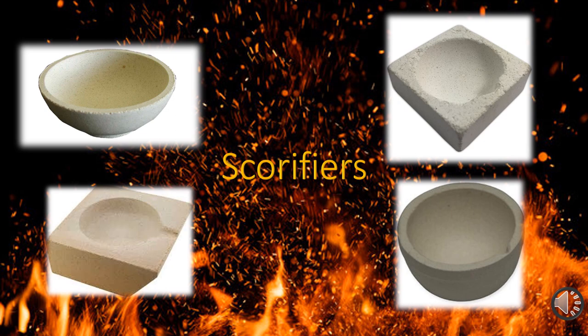Scorifiers are small fire clay crucibles. The difference is in their size and shape — they are small, usually circular and shallow; however, they may also be square. They are thick-walled and smooth on the inside. As with crucibles, they too must be impervious to molten lead and slag. They are made to resist corrosion from the reaction of molten litharge, as they are made with a minimum amount of uncombined silica. They come in different sizes, determined by their diameter, ranging from 2½ inches to 4½ inches. Their use will be discussed in a future presentation on scorification.